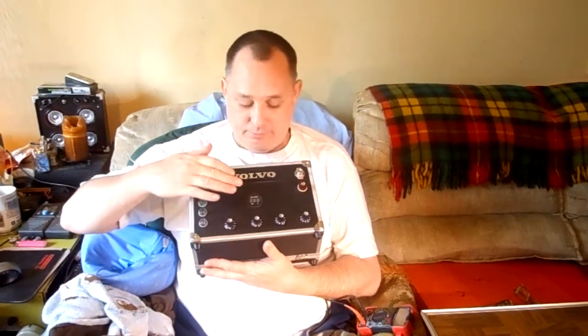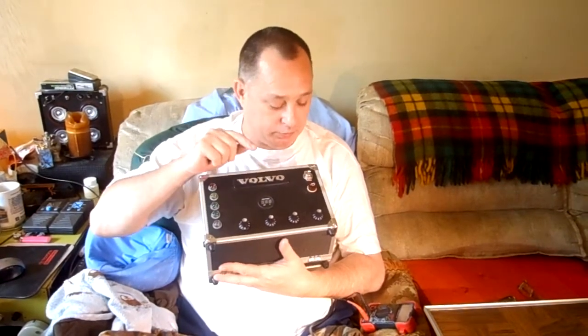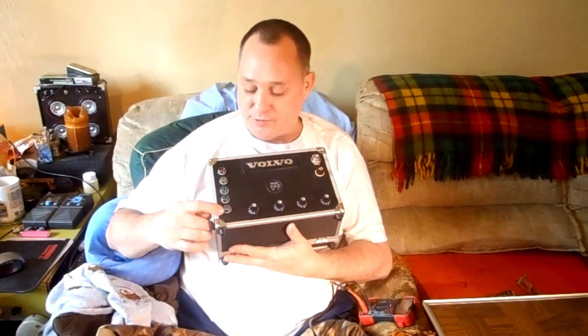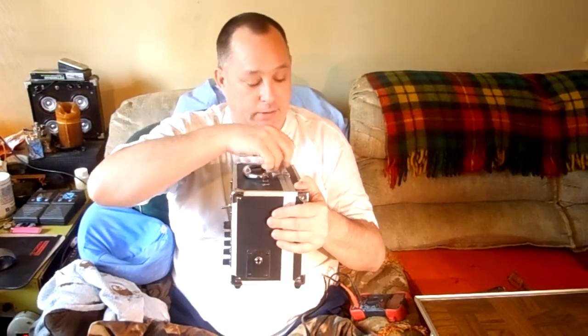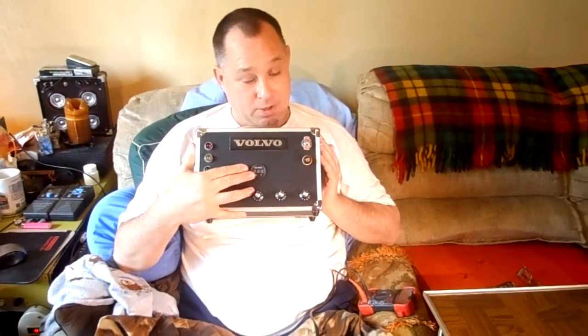It's a mono amp. I started out with a 1-amp fuse, popped that, popped the 2, I think there's a 3 or a 5. Three to 5 is a good value when you're doing one of these amp boards. And then there's a blue LED that comes on when the amp is running, and these LEDs bounce depending on how much signal you're throwing at it. There's the input, there's the speaker output, and here is the button that I press to activate the voltmeter for the battery pack.